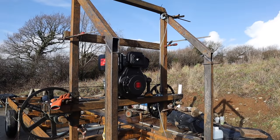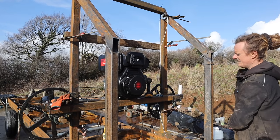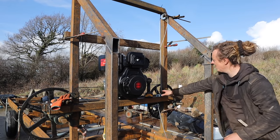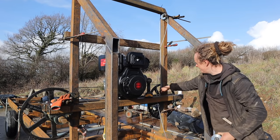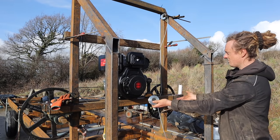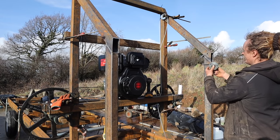Alright, so I've just rested the engine in place, roughly where it's going to go, just so I know I'm going to clear everything. The way I'm going to do it is I'm going to have the winch mounted on here, it clears everything, and then a pulley here, up there, and it'll come down, and there's a pulley either side of this. Because it's slung between two pulleys, I think it should raise it evenly, even though it's winched from one side. We've got bearings and little...